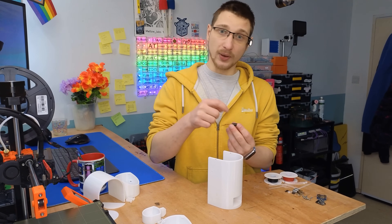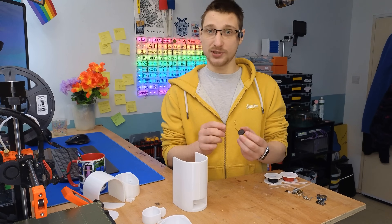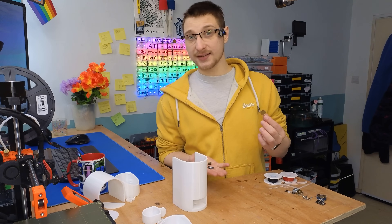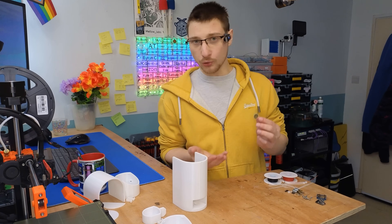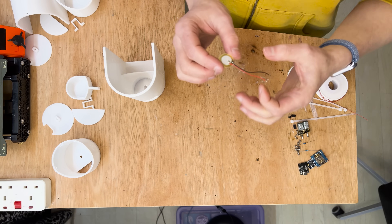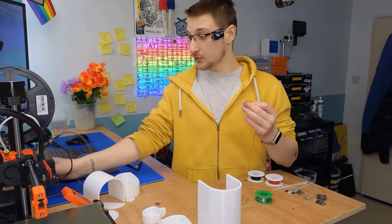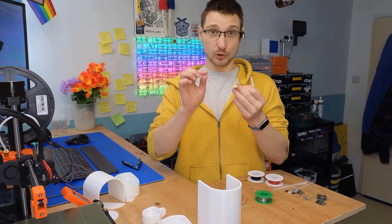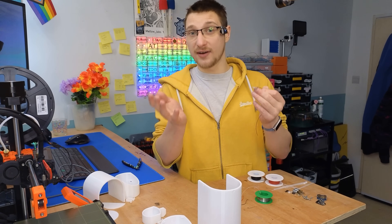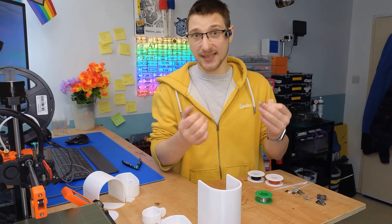This is the actual thing that detects whether a pill has been dispensed. My one comes in a little plastic container but we just need the bare piezo module itself. You can get these without the enclosure. Now I'm going to swap these wires — they're not quite long enough and I'd rather fully swap them. Do be careful when you do this yourself: the film on here is super thin and you have to solder directly to it, and with just the tiniest bit of heat it likes to just vanish. If you don't feel confident doing it, just try extending the wires instead.